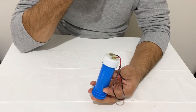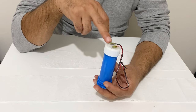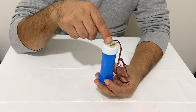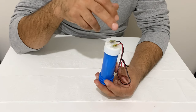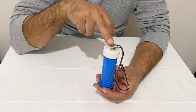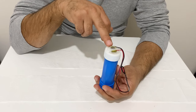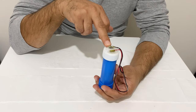Since that time, over six months, I have charged and discharged the supercapacitor more than 1,000 times and it is still working very well. After 1,000 charge-discharge cycles I will open it up and we will see the condition of the materials inside. The maximum output current of this supercapacitor is about 5 amps, the operating voltage is 1.4 volts, and its capacitance is 500 farads.